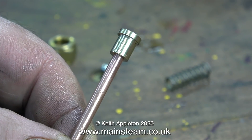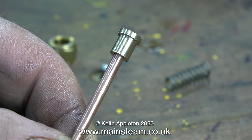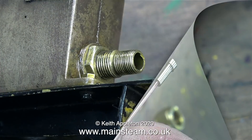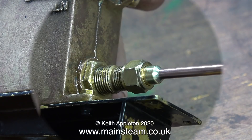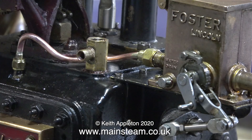The previous video was a special episode about how to adjust the oil delivery of a Foster-type lubricator. Here is a shot of the part I had to make — a special union on the outlet. I fit the stainless steel ball, then a spring, and then my special fitting, which compresses the spring and in turn holds the stainless steel ball against the opening. This clip shows after I silver soldered the union to the end of a piece of 5/32nds of an inch pipe. Now this mechanical lubricator should deliver slightly less oil to the cylinder.